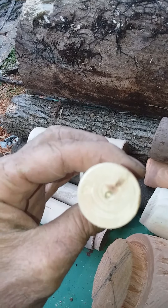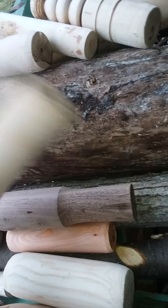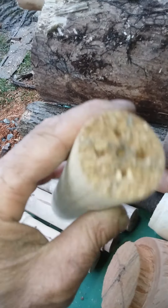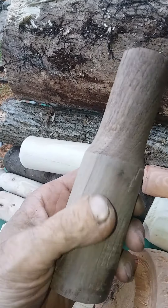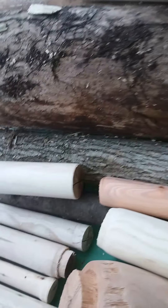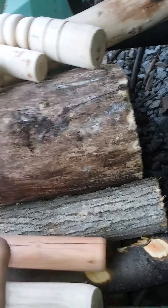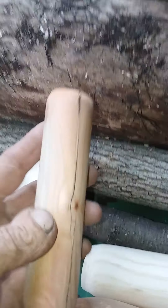That's a piece of apple, and I tried putting some finish in it — I don't know if it'll work or not. That is red cedar, which isn't really red; it's a little harder than white cedar. That's butternut — it is so light, it's a hardwood but it doesn't weigh anything. That is black walnut, which is kind of pretty but it has a tendency to chip when you're turning it.